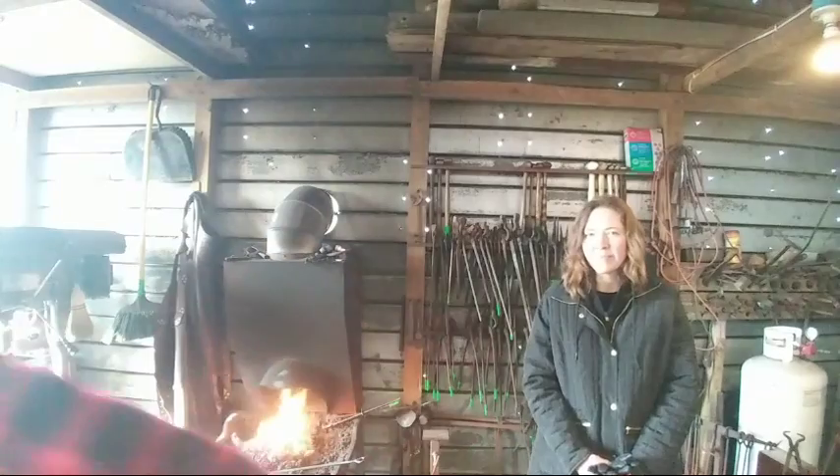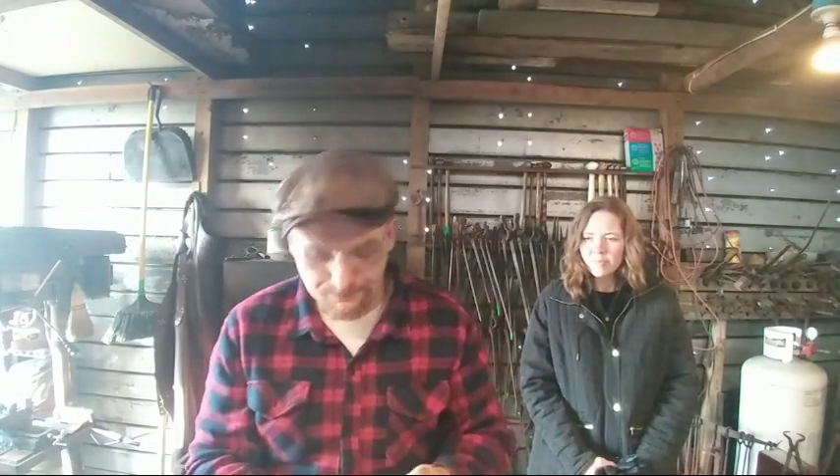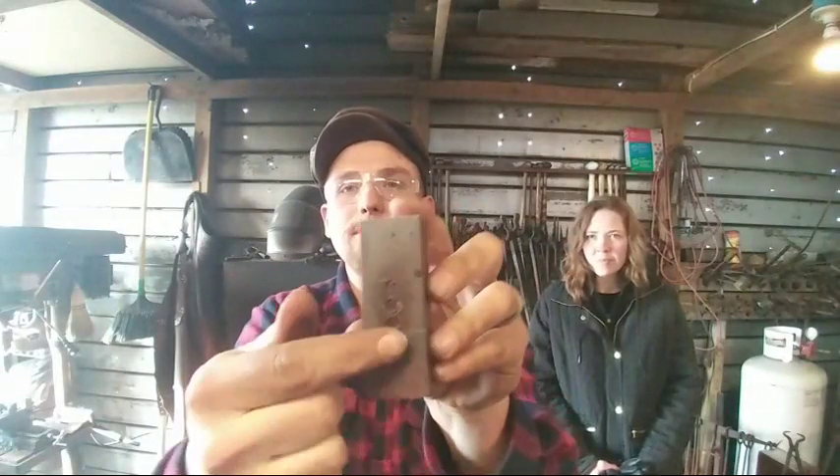This live stream I'm estimating is going to take about three hours, so if you need a potty break, drink break, or a catnap, I'm going to be here for quite a while. We're starting with a three-and-a-half inch long, inch-and-a-quarter square 1045 steel blank. We're going to forge this out into a symmetrical taper and then punch out the webbing of these three holes. I did this so it could save time on the actual drifting and punching and not deform too much of the sidewall.